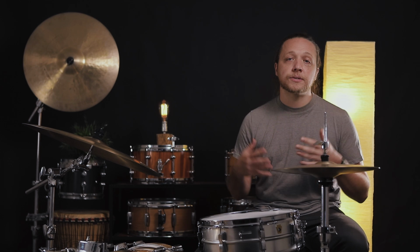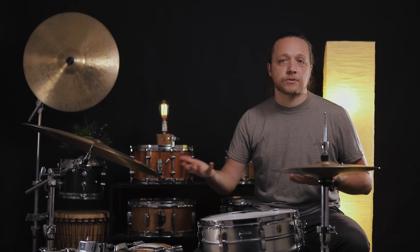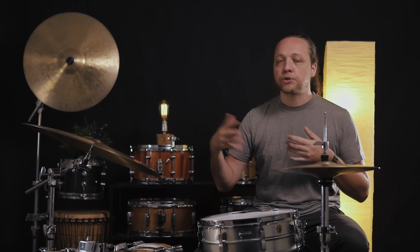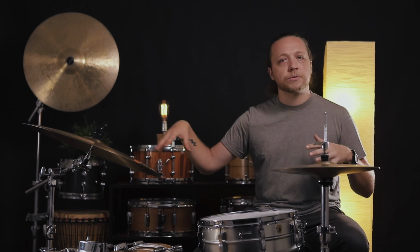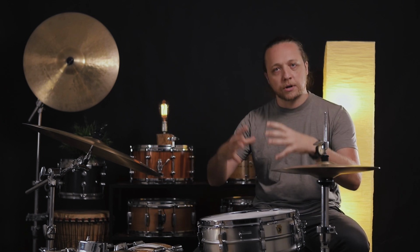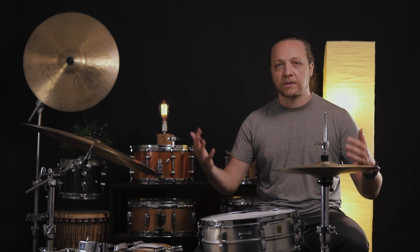Now, just as lathing simply is removing metal from the cymbal, hammering simply is work hardening certain areas of the cymbal relative to other certain areas of the cymbal. This is interrupting the ease with which it resonates and causing overtones in different parts of the cymbal to interact in different ways, creating zones of different sounds, small zones, larger zones, etc., that really change the whole behavior of the cymbal, both in feel and the overall sound of it.